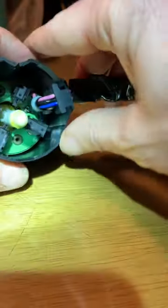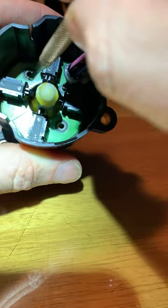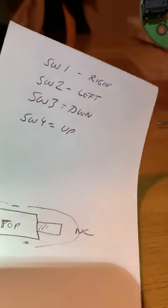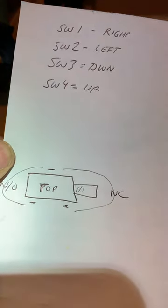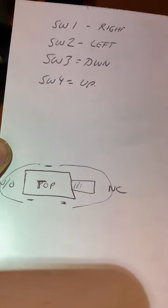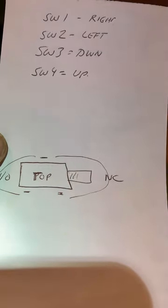Take the tie wrap off. Underneath this, holding this platter on, you'll have two Phillips screws — both here and here. Then this whole piece just comes right out. Set the other piece aside. So this is basically the switch liner — that's what you're seeing. When the switch operates, there are three contacts on the switch: a normally closed and a normally open. I had one switch that was intermittent — I'd push it, lose contact, it would go to a short, then I'd see resistance and go to a full short again. That's when I decided to take it apart.